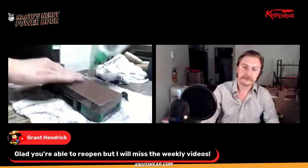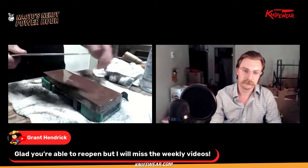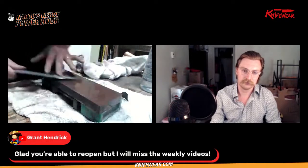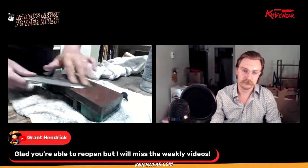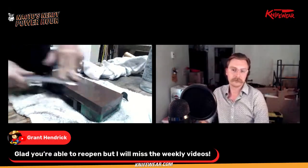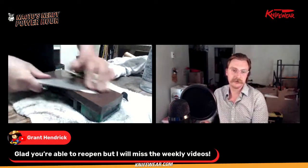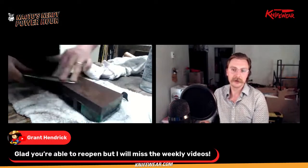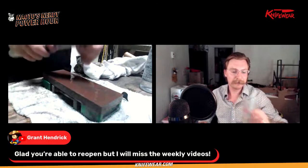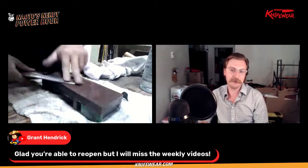In order to get a cleaner bevel, what I have to do is use a much harder stone to get the shinogi, or the bevel line, cleaner. To really crisp it up. Gotta have a crisp shinogi. It's harder with the double bevel, to get it the same on both sides, right?